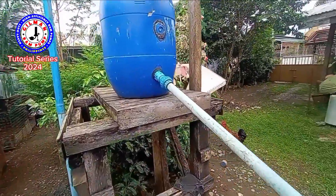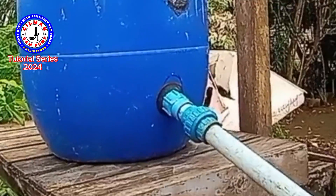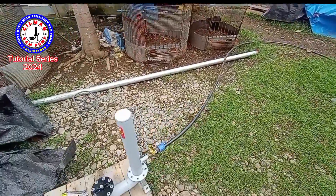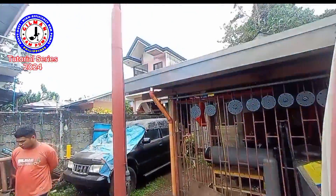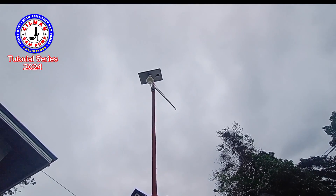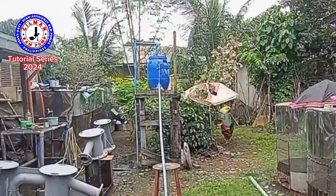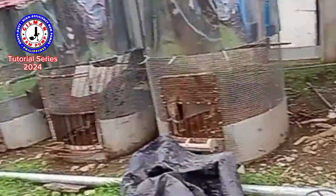This is how we connect our drive pipe to the drive tank, and from the drive tank to the ram pump we have a pipe — the black one — going up to that height, so the water will come out right here. It's now overflowing and I'm ready to operate the ram.